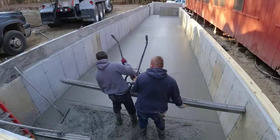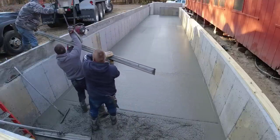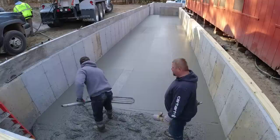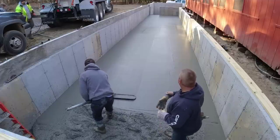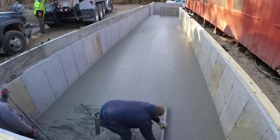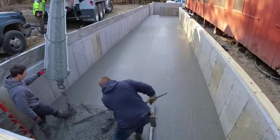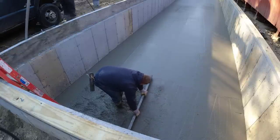This is probably one of the most awkward things about the vibra screed — getting it out of the foundation when the board is still on it. It usually takes at least a couple guys, one on the inside and one on the outside. The board comes off with just two bolts, pretty easy, but us concrete guys are always in a hurry. Now Luke's going to finish up by hand — we grab a shorter board, screed our way into a corner, then jump out the corner, pull the ladder out, and fill in the holes left by the ladder.